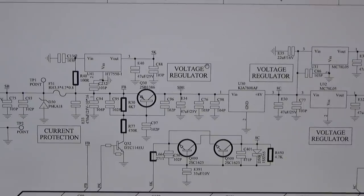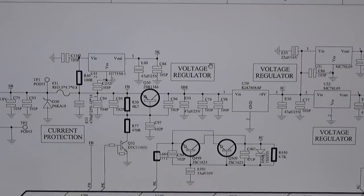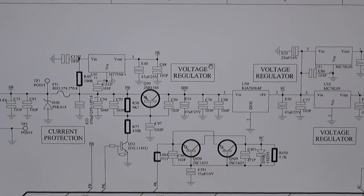And thus I concluded that it might be the regulator itself. But after I did a test on the 5K bus line, we see a 5 ohm resistance, which is almost a short to ground. That should not be there, considering that on that line we only have our microprocessor and EEPROM and whatnot.